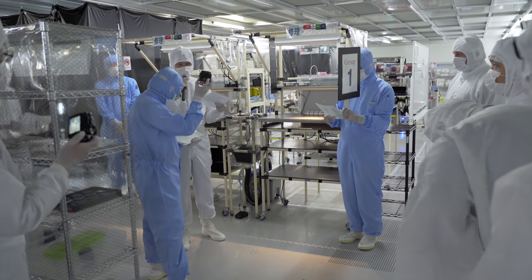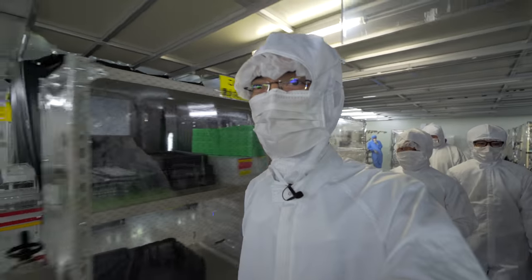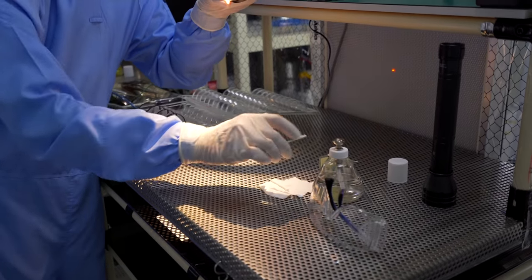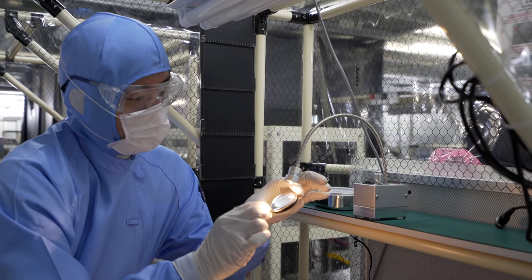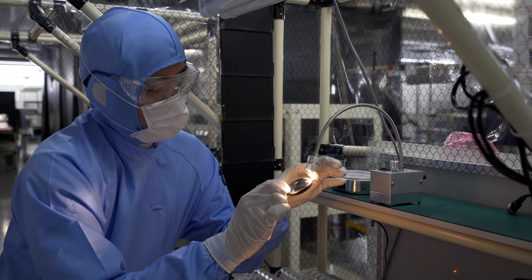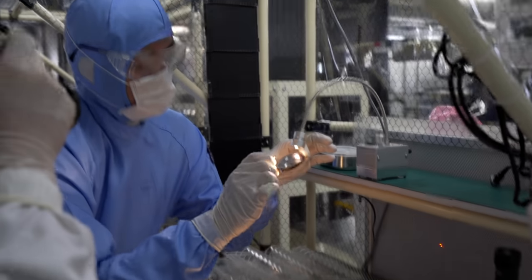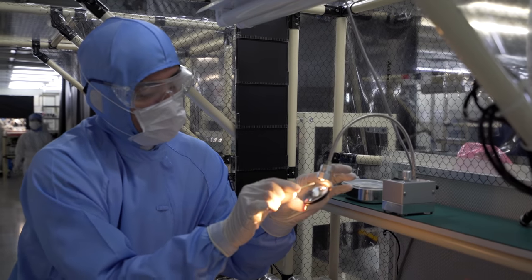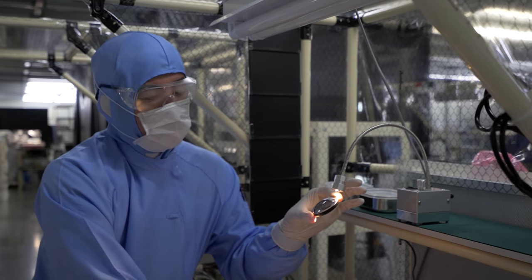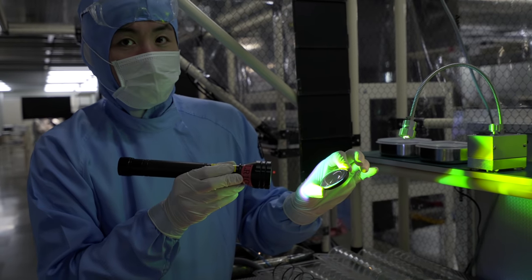Here is the assembly of the 100-200mm lens. This is one of the elements of that 100-200mm lens. This is putting on lubrication, and again it's all done by hand. I've seen this process last time as well. How do they clean it? It's just a standard toothbrush you can get from 7-Eleven. In the front is a 45mm lens for GFX. This is demonstrating cleaning with alcohol. The trick is cleaning it in one direction. He's only done half of it. What kind of light is this? It's just the colour — it's green light to reveal contamination.